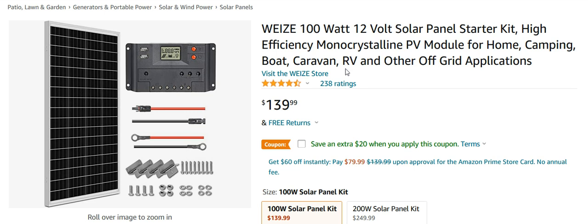If it's only 50% depleted, then it's going to take half of the 8.6 hours — about four hours to charge. Also, the temperature is going to affect your battery. They figure if it gets really cold, your battery is only going to be about 70% efficient. You can improve that by building an insulated box to put your battery in, or by burying the battery underground. That will help with the cold.